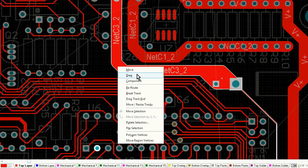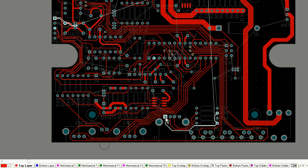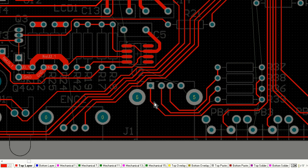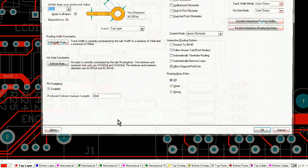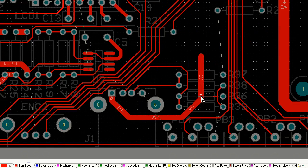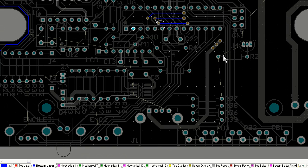In fact, if I put a bit more thought and effort into it, it almost comes down to I could have done it with maybe a dozen jumper links or something like that. But these days, unless you're manufacturing 1 million of these things, there's not a huge cost advantage to going with a single-sided PCB. So I'm using the double. I plan to have all ground plane on the bottom.